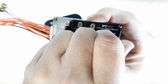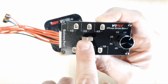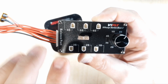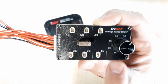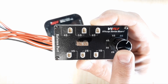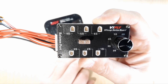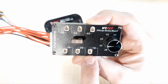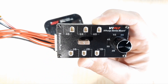We're going to turn this all the way to 6S. Notice there's a 5-amp fuse here - I'm not really sure why, because this knob can only handle 1.5 amps. All the current flows through the knob, and it can only handle 1.5 amps. That's fine, because with a 6S configuration using 300mAh or 450mAh packs, you're never even going to touch that limit.